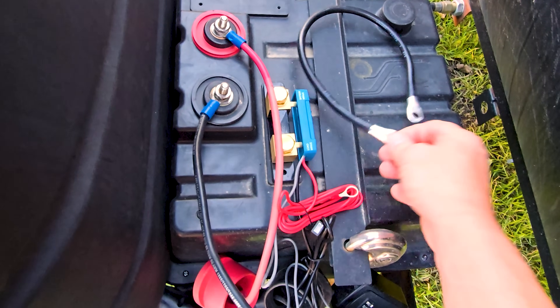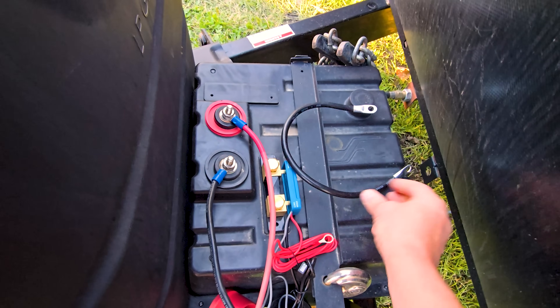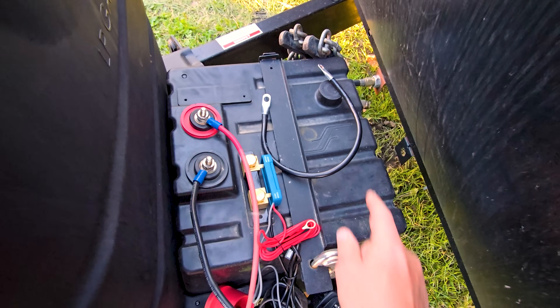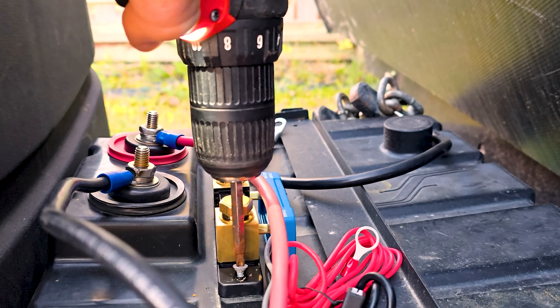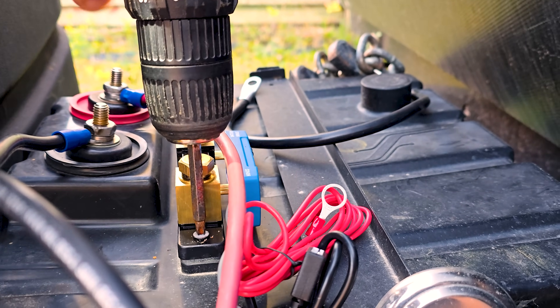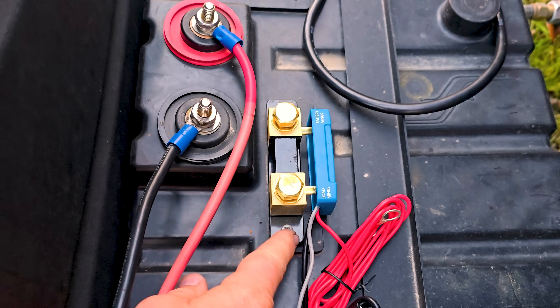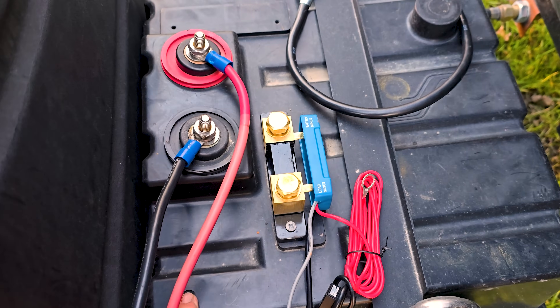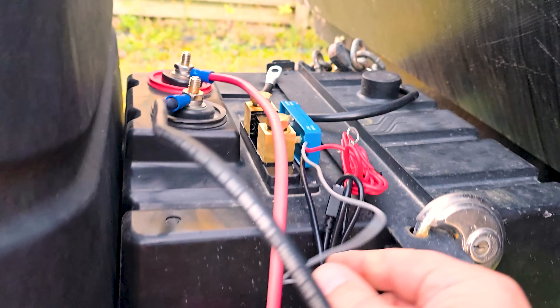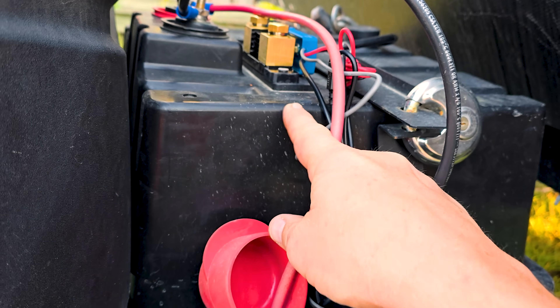I'm going to undo this battery. I do have a jumper wire that I'm going to use — if you don't have one, I'll put a link in the description. It looked like it was made exactly for this; the holes lined up perfectly. You can see these little nubs — I just used some self-tapping screws. It's soft plastic so you want to be careful you don't go in too far because the battery is inside here and you definitely don't want to drill into that battery.